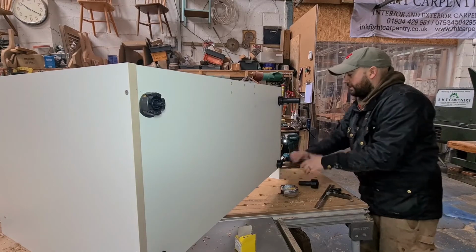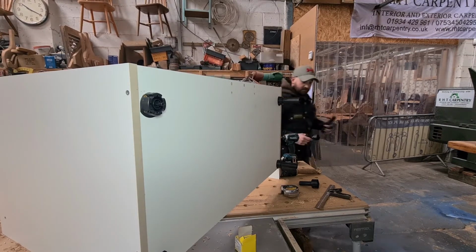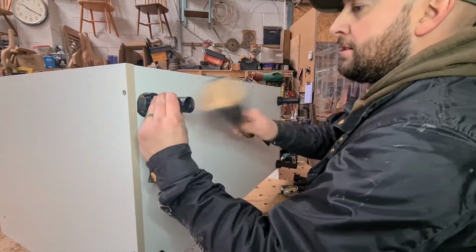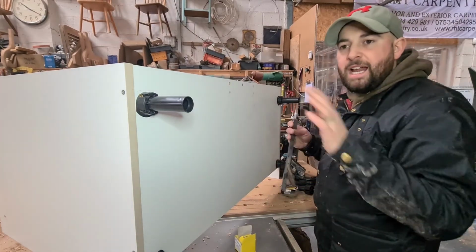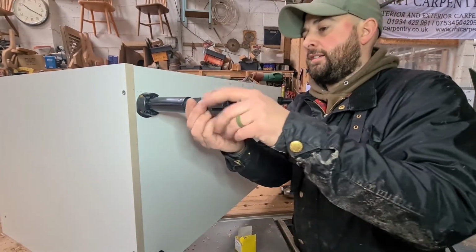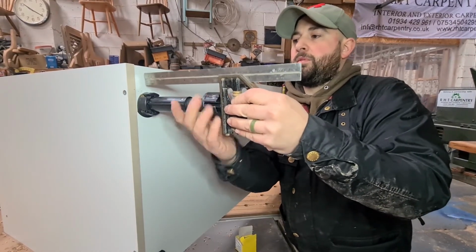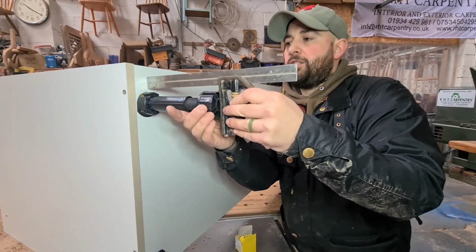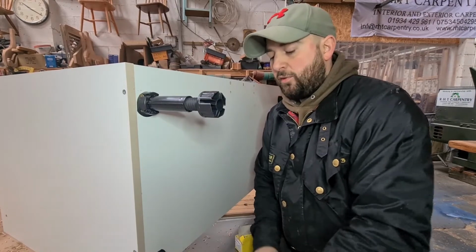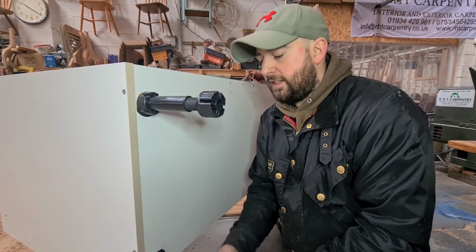So my tip is, when you get the legs all on, instead of worrying about levelling out all the room and stuff like that, get one unit made up, get your combination square, get one leg on, and then set the height of the unit to the bottom of the combination square. Do all 4 legs like this on every single unit. Then when you go to install it, if the floor is level, your kitchen units won't need much play, and you've already got your height set for your plinth or your kickboards, whatever you want to call them. But that is the quickest way as a fitter.